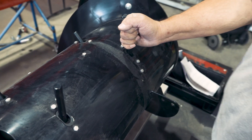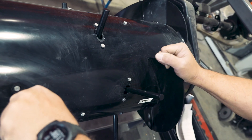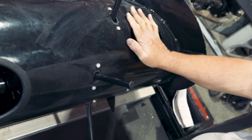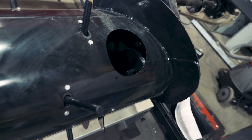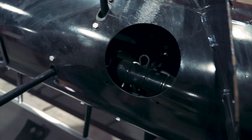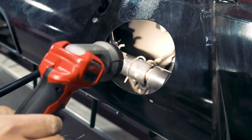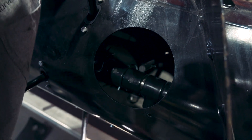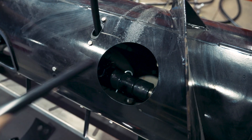The process to remove the fingers is fairly easy as long as you can get your hand in there. On this cutaway we've got some additional holes that make it a little bit easier, but all augers have access plates — normally there's a plate over here and when you remove it you have access to your fingers. We pull the clip out of the finger, and now the finger can be pulled out. Just reach in, pull out the finger, and remove it.